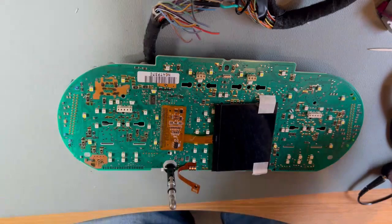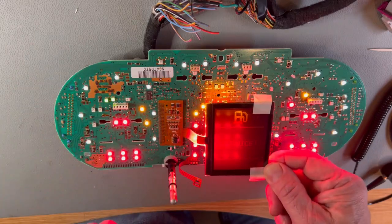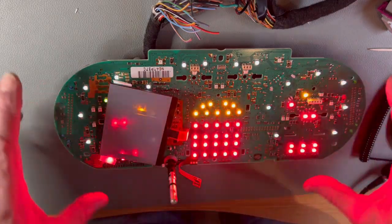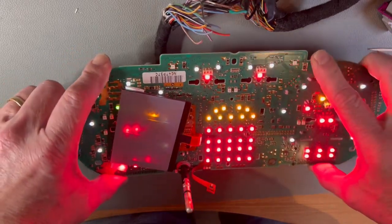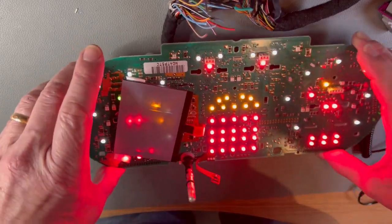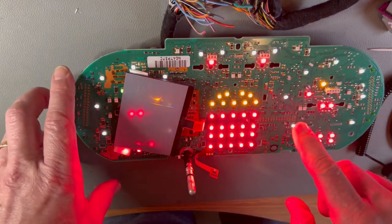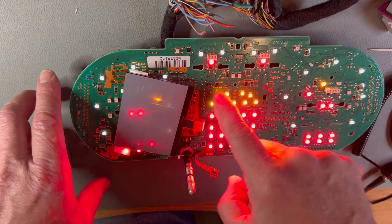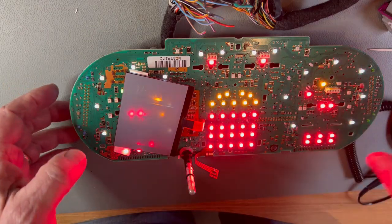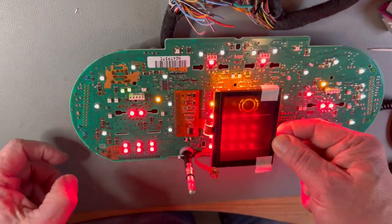If I power it on, you'll see the lights start to come on — and you can see the display is actually working. We haven't got the diffuser in yet so it'll look a bit strange, but we can gently fold this back — it's only glass, it won't short anything. You can see the display illumination and this matrix. As a rule of thumb, we usually resolder these resistors here because they're responsible for feeding power into the top part of this display and are prone to fail. There are some on the back too, so it takes just a few seconds and we resolder them anyway.